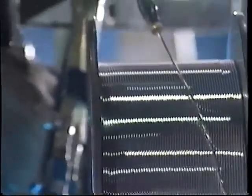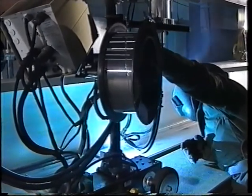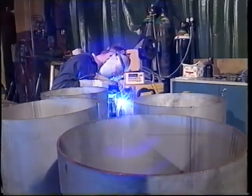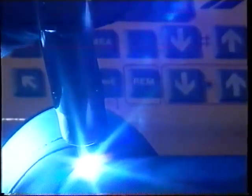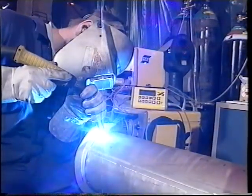The price of thicker wire is less per kilo, which also means lower wire costs. Thicker wire also ensures proper feeding of the wire when welding with softer filler material, such as aluminum. With pulsed arc welding, you have very good control of the heat in the arc, and at the same time the stable arc ensures spatter-free welding.